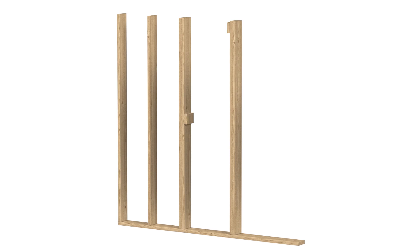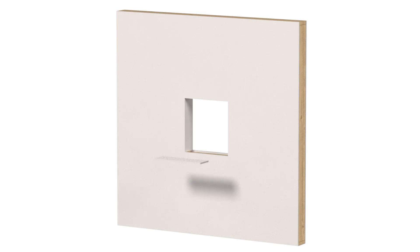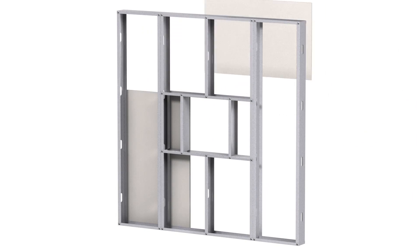When you are framing the opening, follow the manufacturer's installation instructions. The figure shown can be used for wood and metal stud construction. Shown is an alternate framing method that can only be utilized for metal stud construction.